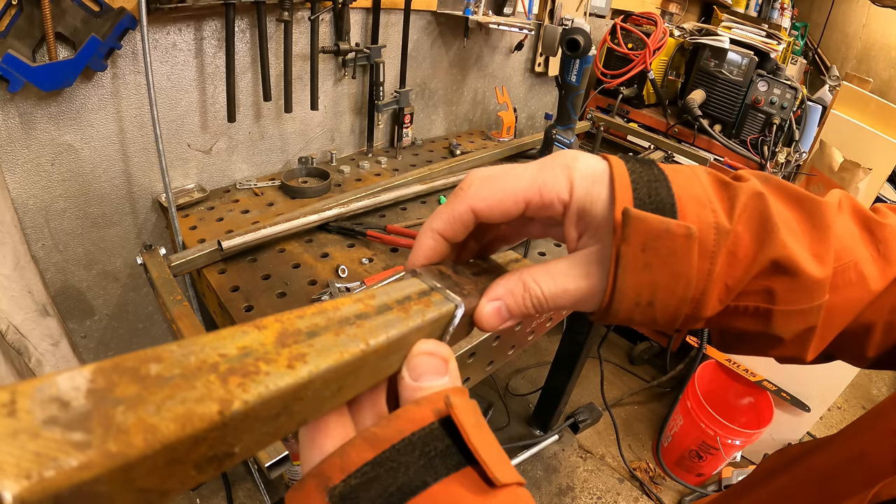Here's the jig — it'll definitely look a lot nicer when I get it painted. These are the lockdowns. This holds the back of the cant here and it's kind of got an angle cut to it. This is adjustable. This is your adjustment for how high you want the cant. These are your adjustments for timing your cams to make sure they stay in alignment. This is your level adjustment — I figured I'd put it on there just in case. Handle, super simple. It won't squeak when I get it all lubed up, but first I want to double check if it works good, then I'll paint it.